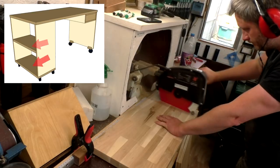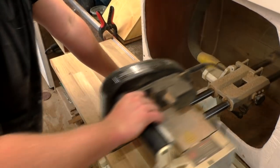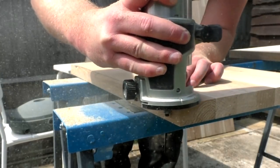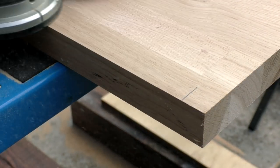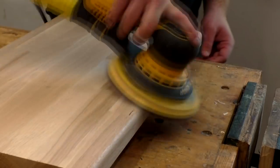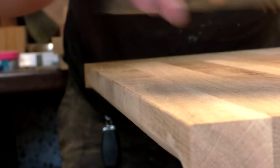The upper shelves would need to be cut shorter than the bottom shelves, and to get the correct measurement for those I measured the thickness of two pieces of plywood together and then adjusted the stop block on my mitre station by that amount before cutting them to length. I used my trim router to add a round over to the long edges of the upper shelf — later I'll add a round over to the desktops too and I thought it would be nice if the shelves matched the top. For the bottom shelves I wanted the round over to stop shy of the ends where they would meet the plywood side panels, so I marked up the thickness of the ply onto the oak so that I knew where to stop. I then sanded the shelves to get rid of any burn marks left by the router and smooth everything over, using 120 grit paper. I used my block plane to ease over the hard corners of the bottom edges of the shelves, which makes the edges less prone to damage and nicer to touch too.